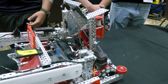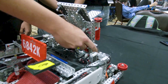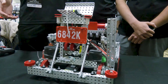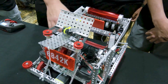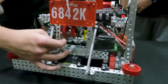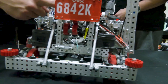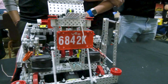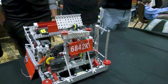One thing that's really unique that a lot of other teams didn't have at the beginning of the season was the power system. We have an 11-watt motor here and a 5.5-watt motor here. When we were originally designing our first robot, we realized we didn't really need 11 watts on our intake as the tri-balls aren't very heavy, and you can't really have just an extra random half motor on your drive base. So we decided to put it on our shooting mechanism, which allowed us to have extra power and a much faster ratio on our slapper. The bottom axle is a 12-tooth running at 200 RPMs for both motors, geared to a 36-tooth at 66 RPM, then to a 60-tooth at 40 RPM. The slip gear is a double-slip, meaning it has two sets of teeth.